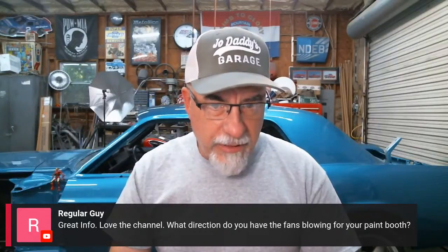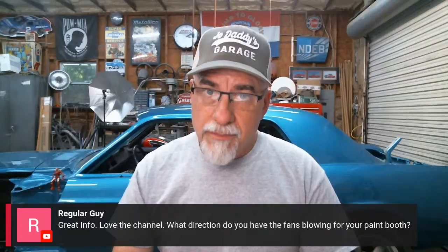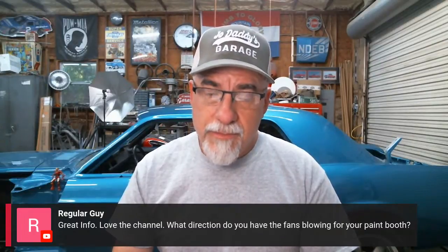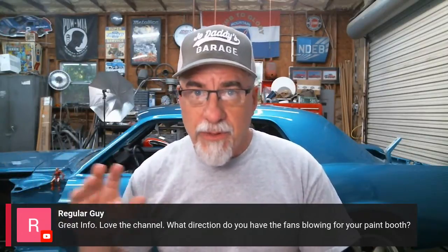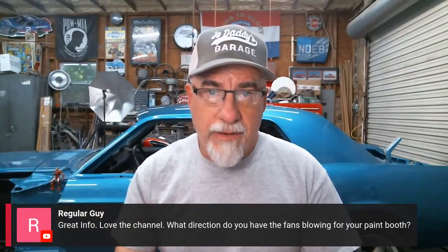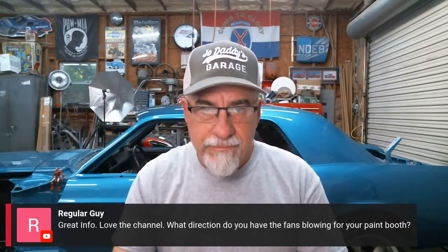Regular guy says, great info, love the channel. What direction do you have the fans blowing for your paint booth? They're blowing out. Yeah, you have to have them blowing out. You want to evacuate any kind of fumes or overspray. So, yeah, blowing out.